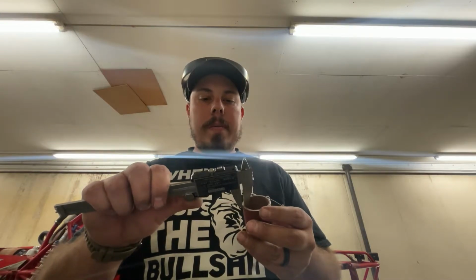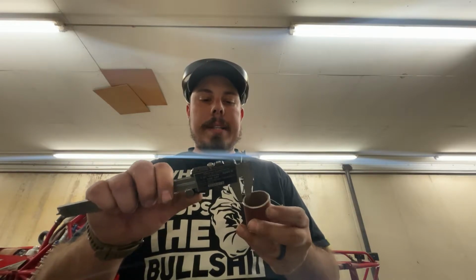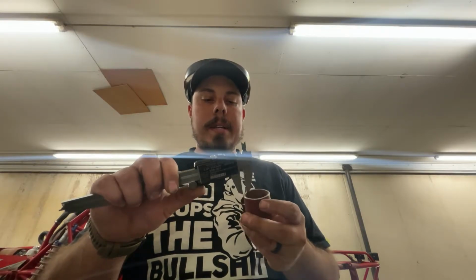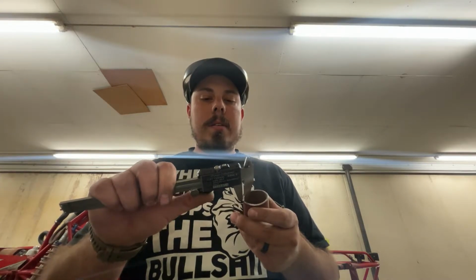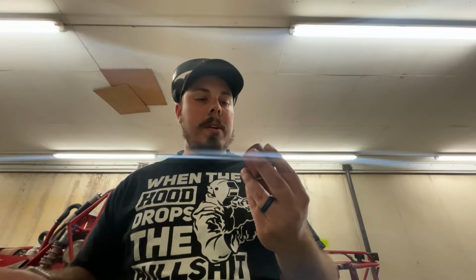We're gonna go all the way around: 0.098, 0.096, 0.096, 0.093, 0.096, 0.097, 0.098, 0.097, 0.095. Okay, so I'm gonna say it's safe to say that this is 0.095 wall, which actually goes with my suspicions that it was too thin wall material.